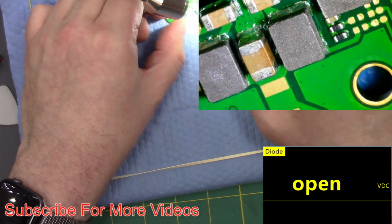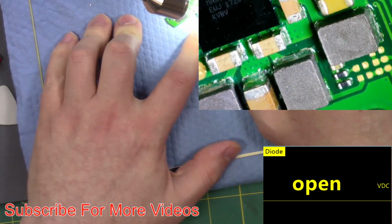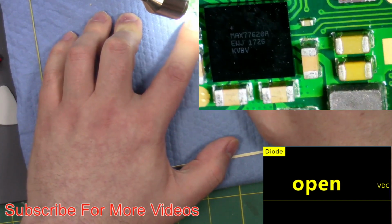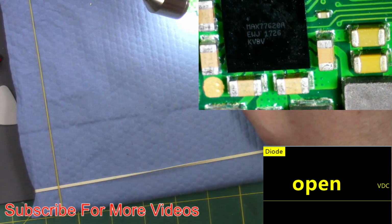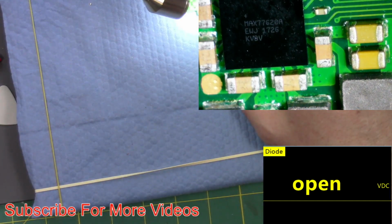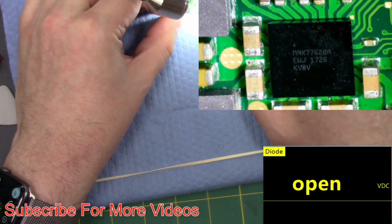I'm going to hold up until after I post the series of videos to see what kind of comments I get on what you guys think I should do. But knowing that I found a shorted cap around this Max, there you can see the number right there, this Max 77620, it is a BGA chip, and I've reballed BGA chips just as a practice thing at my old job, because we thought we were going to use one. So I got stencils, I practiced doing it, and I got it down to where I could do it. I've never pulled a chip and installed a new chip, or removed a chip and then put balls on it